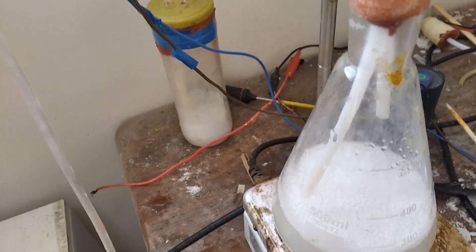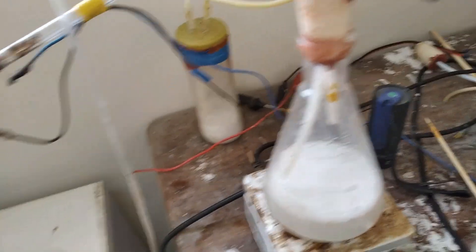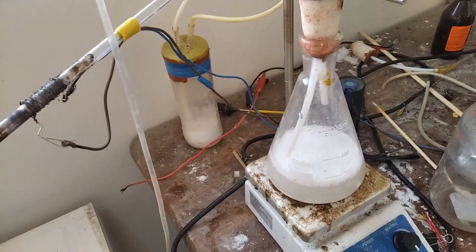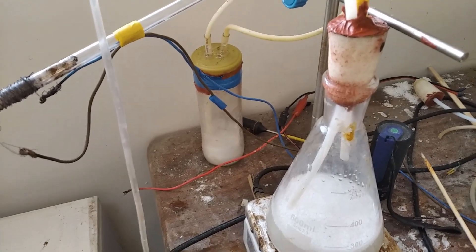The amounts are somewhat arbitrary, but that should be enough because you can't get all the ammonia out of the urea anyway. Your final product still has like 15-20% of the theoretical ammonia trapped within it.